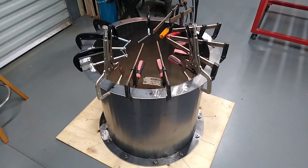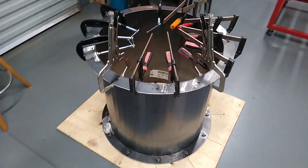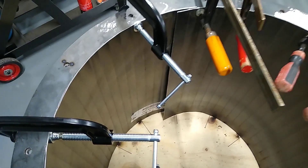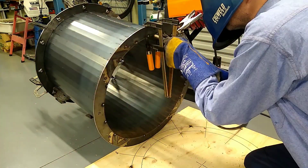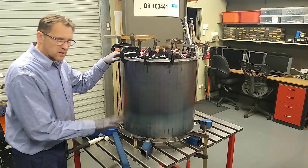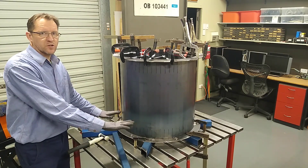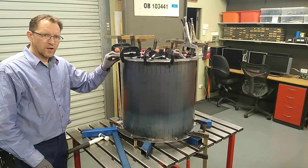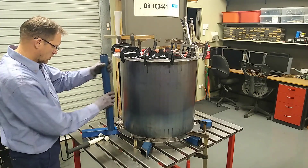The other flange has been clamped on and it's actually straightened up quite a bit, which I'm quite pleased with. Although as I did clamp it, one of the bottom welds down there let go. So the body has been clamped down to the welding table and it's now nice and straight. All I need to do now is adjust this flange in relation to this flange - for that I'm just going to use this yardstick and go around.